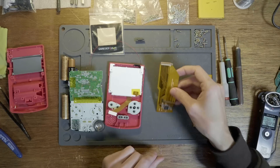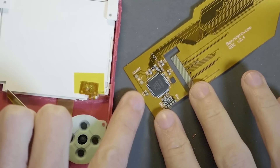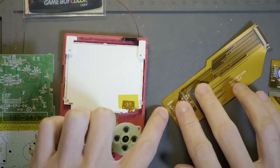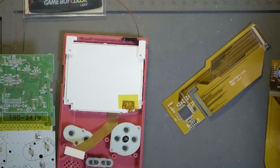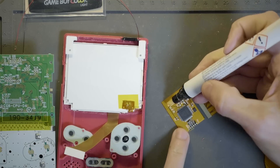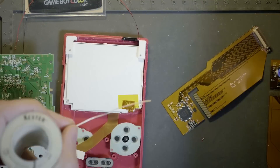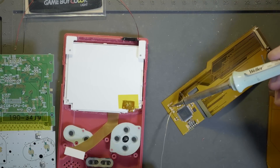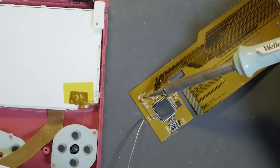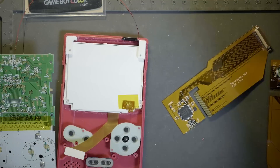Let's do the 2.4 first since this one requires a little bit more to it. You'll notice here that it says 'start' and 'backlight negative' — the only one we need is the start. Get your soldering iron, you may want to add a tiny bit of flux — it's optional — to the little start pad, get some solder, and just tin that little pad.